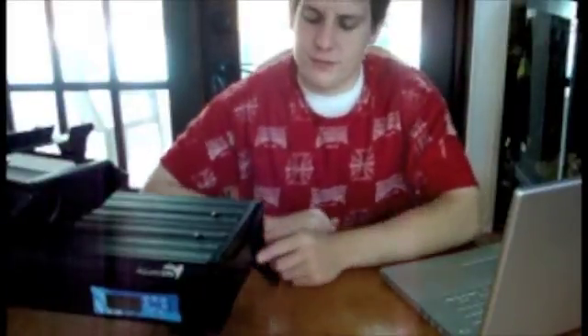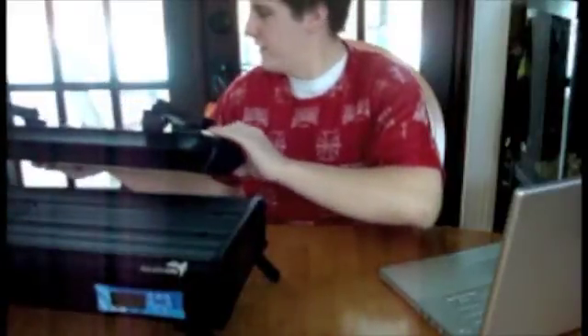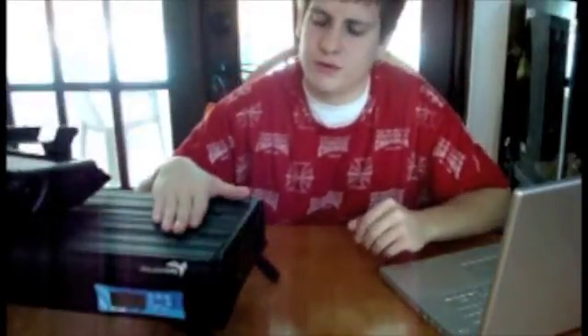Moving on — T5s. Just be careful when you're buying the very high output ones. It's easy to get a bad one. I just stick with the high output ones. Here's a 24-inch one. For the high output ones, the 24-inch ones are about 24 watts. Just in comparison, the T8 24-inch is about 17 watts. So it uses less power but you're getting like twice to three times more useful light. Plus, the T5 fixtures usually come with reflectors — I'll get into that.